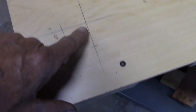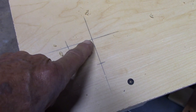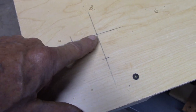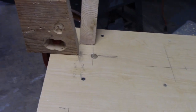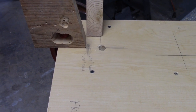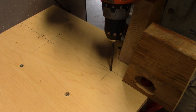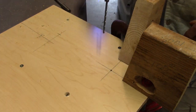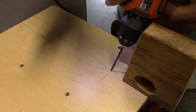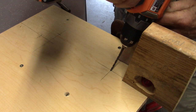Now I'm going to move the jig to this other location. I will step drill through about five different steps, starting with a very small bit. In case I make an error, I can correct it. This is important to do. Once this jig is made, it can be reused over and over, and this should allow me to drill from the top side of the seat to reduce the chance of any tear-out. I'm starting the hole with a small eighth-inch bit, drilled at 90 degrees just to start, and then I'll taper my drill bit according to these angles and follow it in. The very first one is going to guide all the other bits.